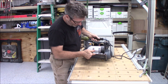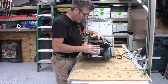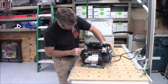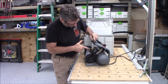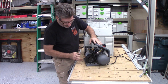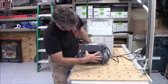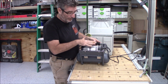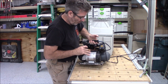So here's what I did. I was able to unmount the compressor from the stand and just push it back. I didn't take anything apart — you've got to be really careful with these copper fittings; you can kink them and then you're kind of done. The tube coming off the compressor loops around and comes back into the tank. By loosening it up I was able to push it back far enough. I took a couple pieces of strap aluminum, bolted those on, and bolted the compressor to that. It moved back about an inch, and that's all it really needed to get in there.